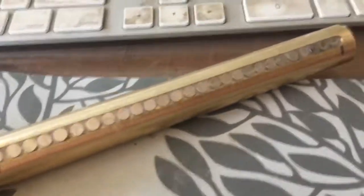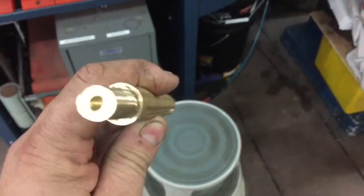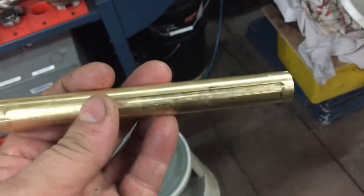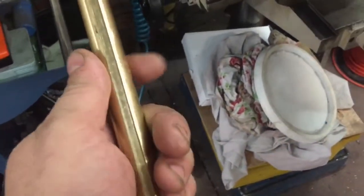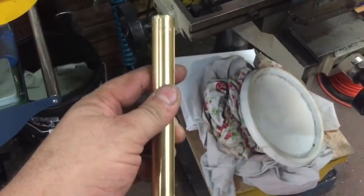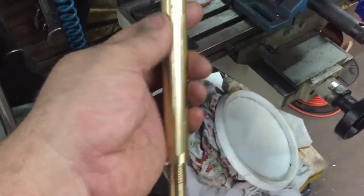Let's take it around to Bruce's and we'll see if it works. So here's a piece of scrap, a new tube. We had the magnets mounted up into it and tried it all out and had two issues. It appears that when the slot was milled it pulled the shaft out of square — we're running about 150 thou off vertical.